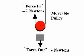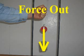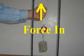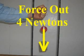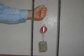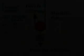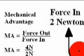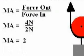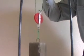To determine the mechanical advantage of any machine, divide the force out by the force in. The force out is the force acting directly on the load, and the force in is the force applied to the machine — in this case by my hand. In our example, the force out is 4 Newtons. The force in is the force we measured as we pulled with our hand: 2 Newtons. Putting these numbers into the formula, we determine that the movable pulley has a mechanical advantage of 2, doubling any force applied to it. By measuring the forces involved, we have calculated the actual or real mechanical advantage of this machine.